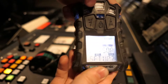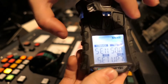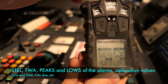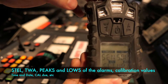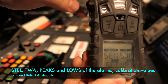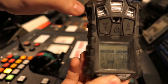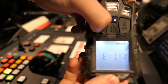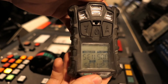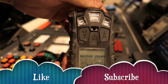Once you have 672 on your screen, press the ON-OFF button briefly and it will say the code is OK, so you access the device setup. In this menu you are able to adjust all device parameters such as short term exposure limit values, workplace exposure limit values, peaks and lows for alarms, time and date, and other functions. Navigating the menu works the same as in normal mode using these buttons, and for selection press the ON-OFF button. That was a brief instruction on how to use the Altair 4X multi-gas detector — thank you for watching and I hope you found it useful.